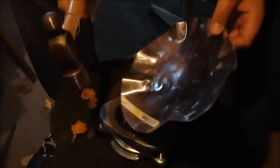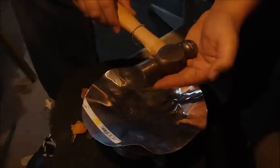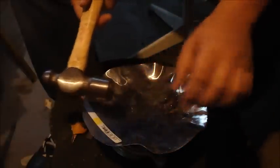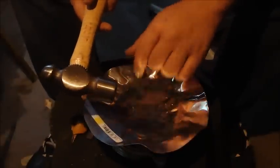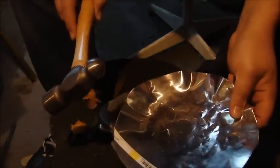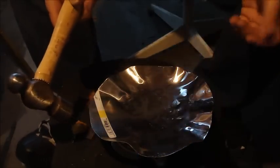I should make note that I'm primarily using the flat end of the hammer right now, because I'm just trying to force the metal to stretch out and get a dome. We don't really need to use the rounded edge. So if you wanted to get started but haven't picked up a peen hammer yet, you can go ahead and start with just a regular claw hammer of the same size. Remember, if you don't own any of these tools, see if a neighbor or friend has one you can borrow — especially if you're not going to do this a whole lot.